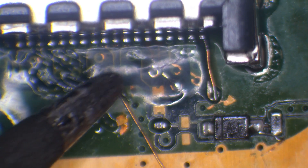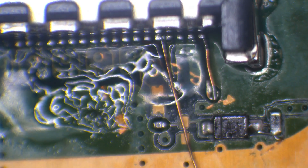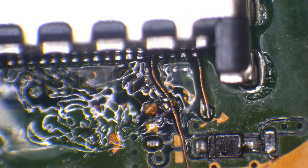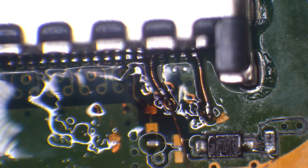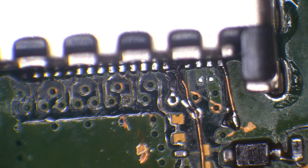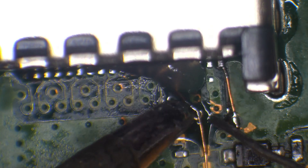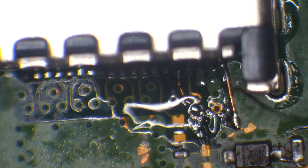I'm going to nudge all of the pins and the jumper wire to make sure they're soldered. Pin two is missing, the rest are soldered. Now I'm ready to run some jumper wires. I've got some enamel wire — 0.1 millimeters — it might seem small but for jumper wire it's fine. I'll run a wire, tack it into place, then come in with the tweezers and solder it properly, tacking it down on the other side where I exposed the trace.